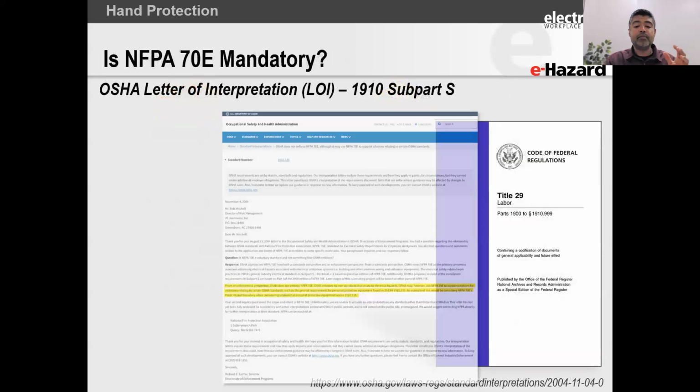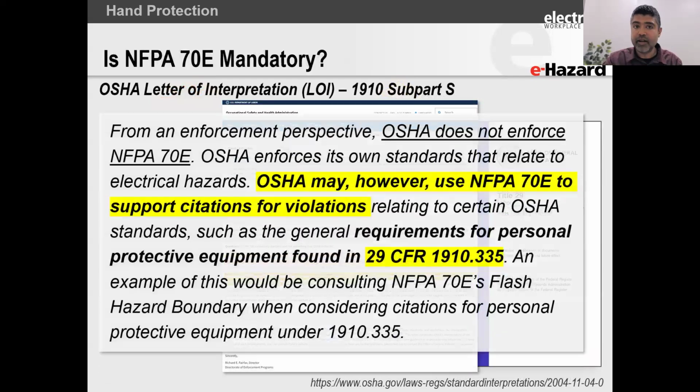All right. And you'll see at the bottom of my presentation, I have some references, and those references will point you to more reading on those definitions, or just reach out to me and I can help you. Now, remember I mentioned on the previous slide that there are standards that drive and direct our activities around electrical hazards. One of the international consensus standards is the NFPA 70E. NFPA, National Fire Protection Association, 70E. This standard dictates human behavior, work practices, some equipment design, and some maintenance directives with regards to achieving electrical safety.